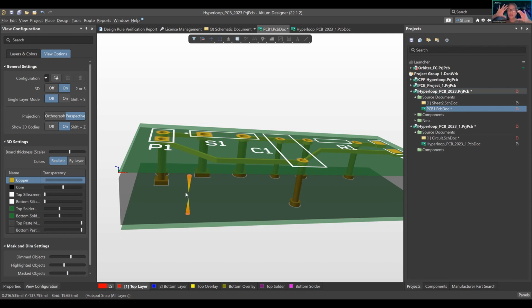They'll cure it with two copper clads on top. Copper clads are basically just copper material. Then they'll squish it together. It's different if you create a one-sided board, which means one copper layer, a two-sided board, two copper layers, and a multi-layer board is going to have a bunch of copper layers in between. That's curing it. The thing about dielectrics when you have multi-layer boards is that you'll have resin. Resin is also an insulator. It's basically like glue. They form all this material together, then smush it together like dough, which is a terrible metaphor, creating the compact form of it. Then they'll squish it with copper, heat it up, and press it together. So you do have copper, core, copper.